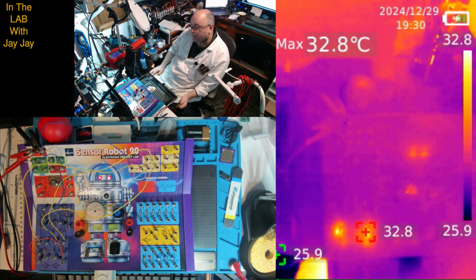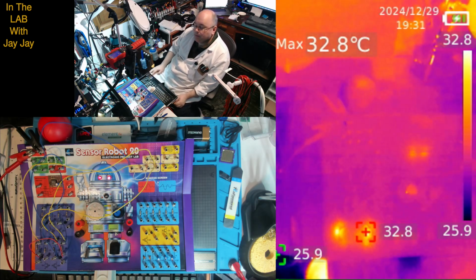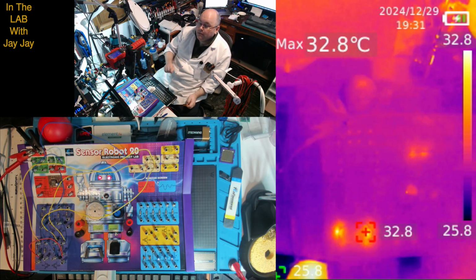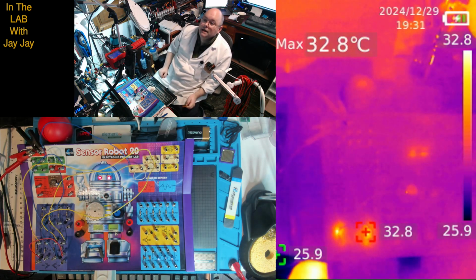And of course, transistor, the name is from transfer resistor, and it's sort of like a valve, and when it conducts electricity, it does so by providing a resistance. Best thought of as a valve, not a pump. So we can see the transistors are chewing up a bit of juice, and less so you can see at the back here, those 2 points, those are the LEDs. So you can see the 2 little LEDs there.